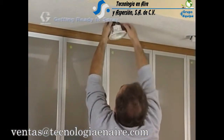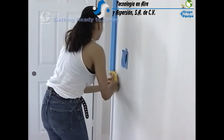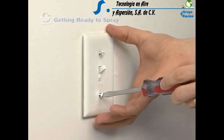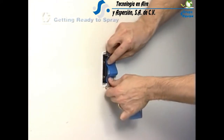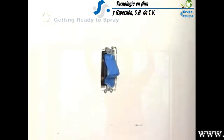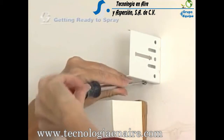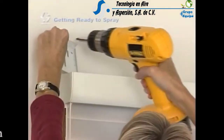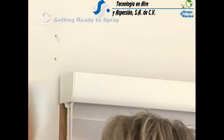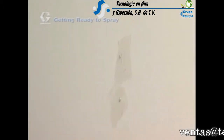This includes removing or covering light fixtures. Mask and paper around trim, doors, and windows. Turn off the electrical supply to the area and loosen or remove cover plates from light fixtures and electrical outlets. Remove heating and air conditioning vent covers. Also remove any drapes and the bracket hardware. If painting a door or its trim, remove the door and place it across two sawhorses or a table. Remove all the hardware from the door. Repair all nail and screw holes with a spackling compound using a putty knife. Look for cracks or holes and fill them in with putty as needed.